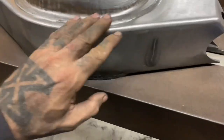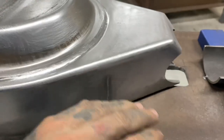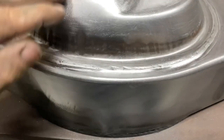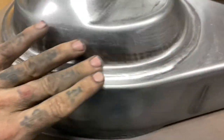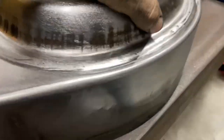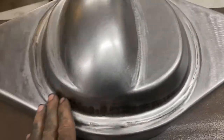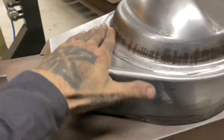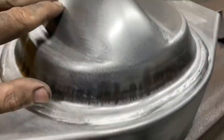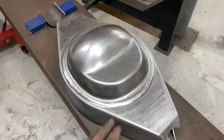60 gritted this - the radius has turned out sick. I always use nice heavy grit because you can feather that radius a lot heavier and really blend it in real good. As you can see here from where these were stamped out, it's just a bit wobbly. So I'm going to get my little 2-inch sanding disc and just go ahead and sand them out - feather them out the best I can just so it looks a bit nicer. I definitely prefer to do this in the metalwork side rather than trying to do Bondo. I do not do bodywork - I'll tell you that right now. So I'll get the little 2-inch and sand all those little bits and pieces out. She'll be ready for another 60 grit and then I can go 80 and start really making this thing look porno.